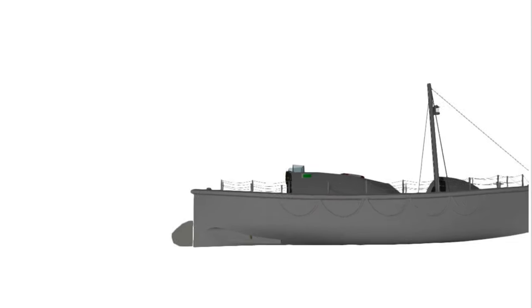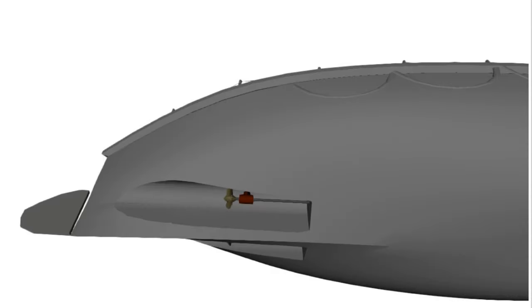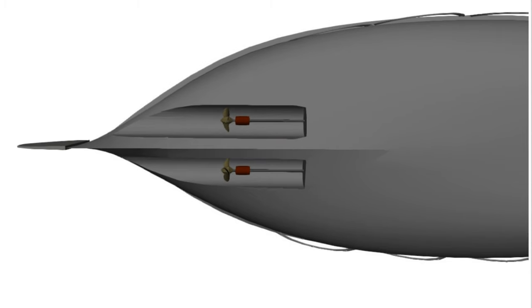Yet, unlike this example, many of Dowager's metal fittings below the waterline aren't physically connected to one another, but they're still just as vulnerable. This is because when submerged, the water acts as an electrical conductor, allowing a small potential difference to pass between these different metals on the hull, and typically eating one of them away. It's as though the metals are connected directly to one another, allowing corrosion to take place. That's where the anodes come in.